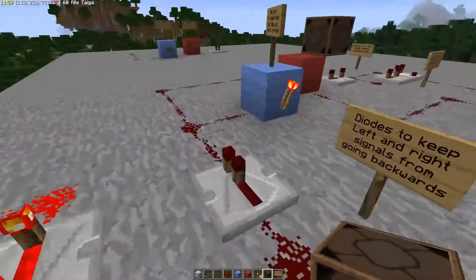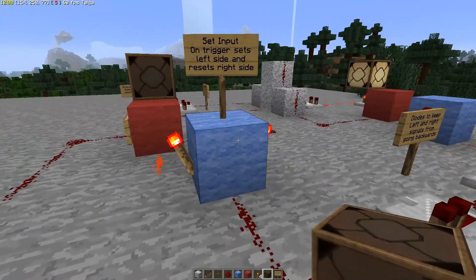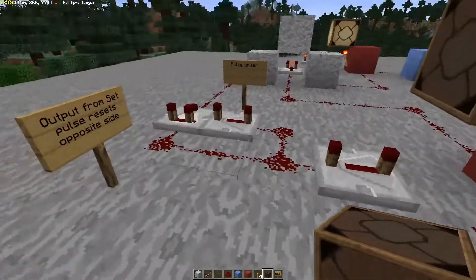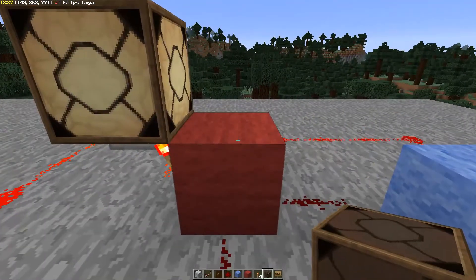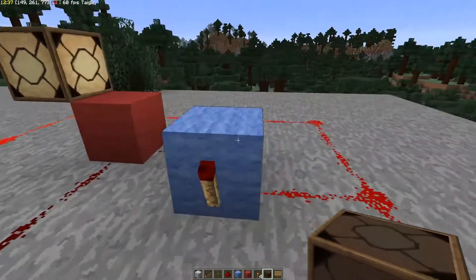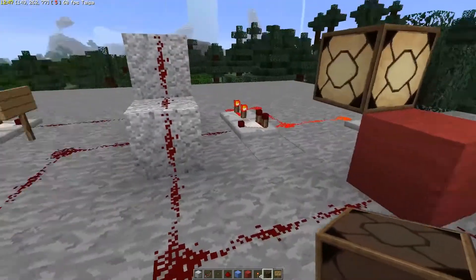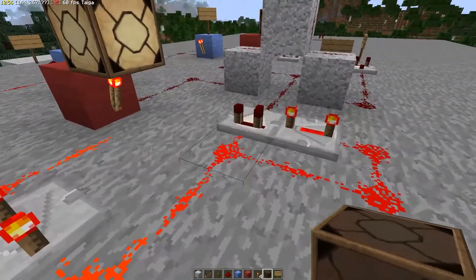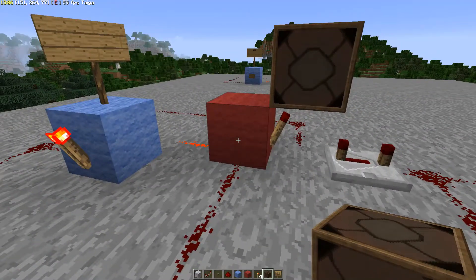So this circuit is going to hit set, and this circuit is going to hit set. But once one of them is already on, hitting set does nothing — it doesn't change anything on that circuit. So when this pulse comes through, it does nothing over here on the side already set. But on this other side, we're going to switch. It's going to come out here, and it also goes through another pulse limiter, sending a short pulse across this bridge to the reset input on this side. So when this SR flip-flop sets, it also resets the other one.